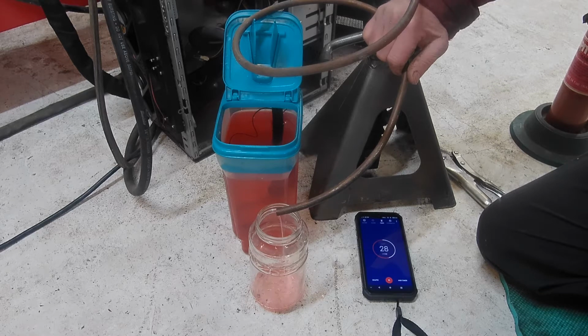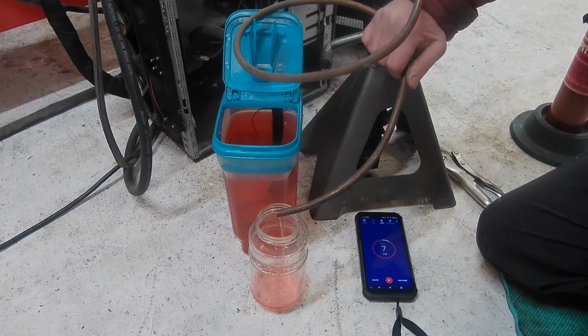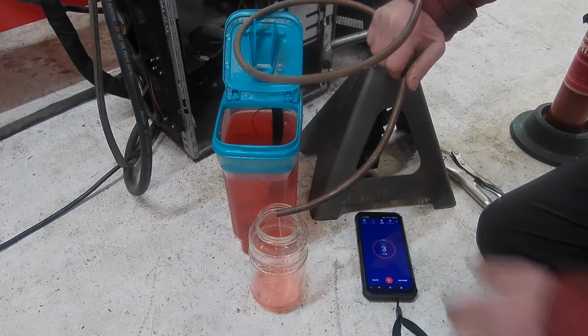So this is a fairly small pump. Free load, it actually pumps a good bit of volume, but it's not high pressure. And the orifice in the torch, where it goes through the cooling loop, is really tiny. It's like maybe 3 square millimeters at most, the surface area of the cut. Okay, I gotta stop this in just a couple seconds.